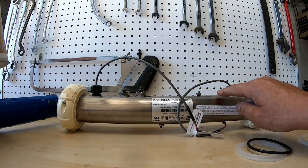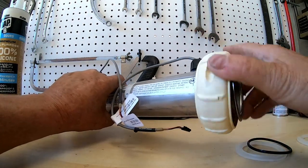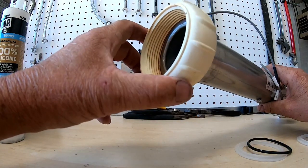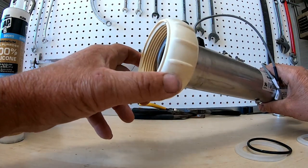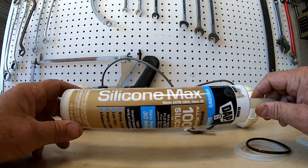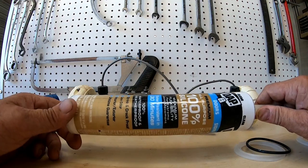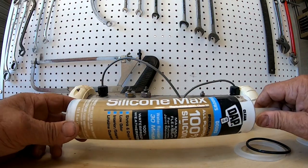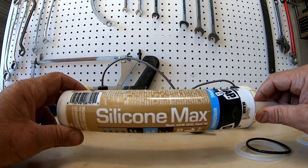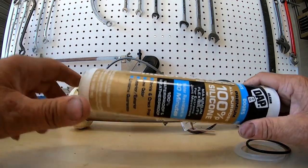This is the heater tube and I've cleaned the sides and got it all ready. You want to make sure these things spin real easy when you go to put them back on. Somebody had put plumber's putty inside thinking they were going to fix the leak — plumber's putty doesn't work too well on hot tubs. The silicone product I use is called Silicone Max, it's 100% silicone, sets up in about 30 minutes, it's waterproof and clear. You can get it at Home Depot. I have great results with this product.